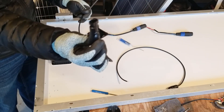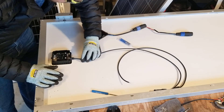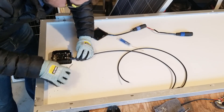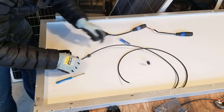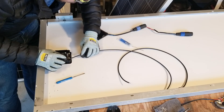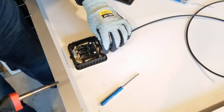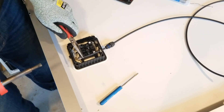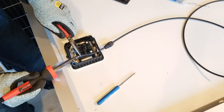I've got my solder in there, I just need to make sure I've got my female negative side here. I want to put this cap on here and feed it in through the female from the negative side. Now I'm just lining it up so my cable will fit right here. Using some needle nose pliers, I'll hold this because it does get hot, and I get it right on that post — that contact. I hold the soldering iron until I see the solder melt a little bit.